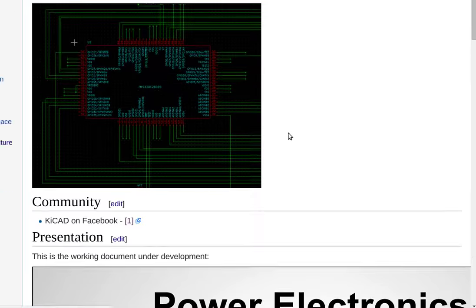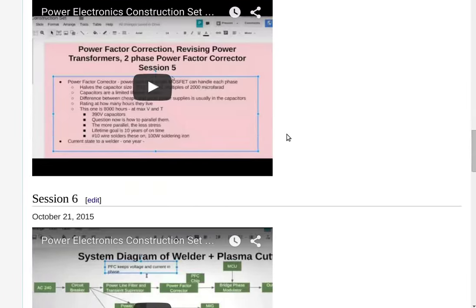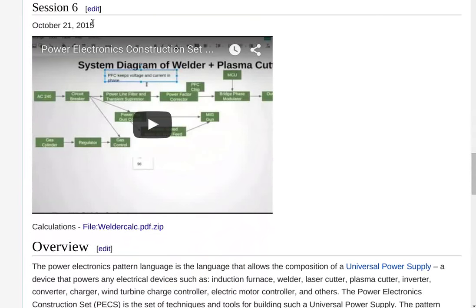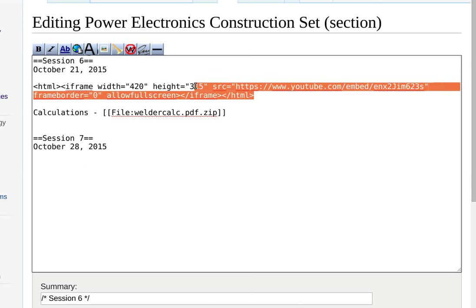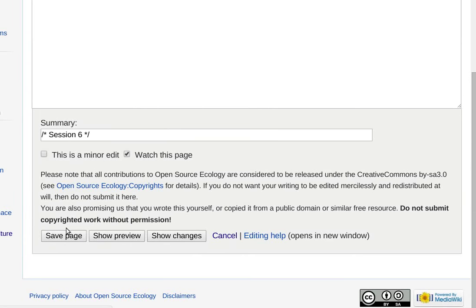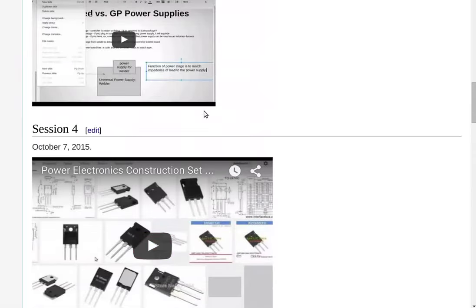When we say less efficient, how much less efficient? The power loss is approximately twice what the previous MOSFET had. There's about 100 watts loss as opposed to about 60 for the previous set. But I feel much more comfortable with an isotop package. I couldn't see how to keep the solder from melting on the leads.